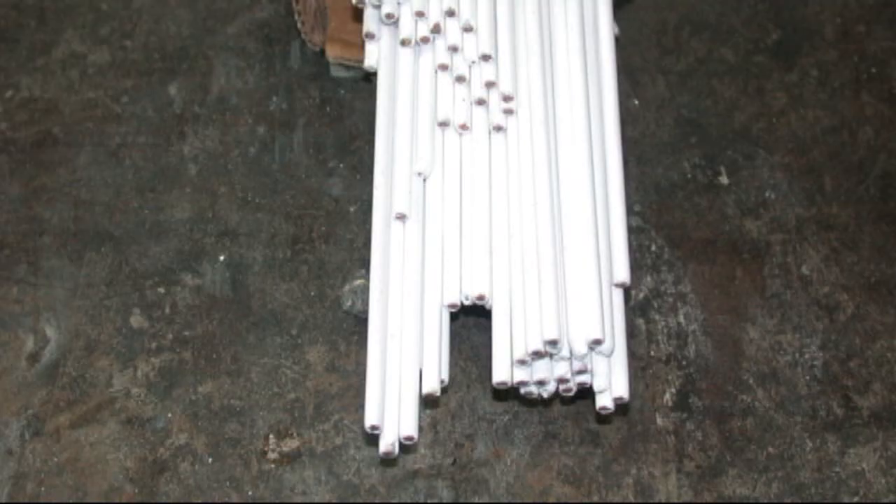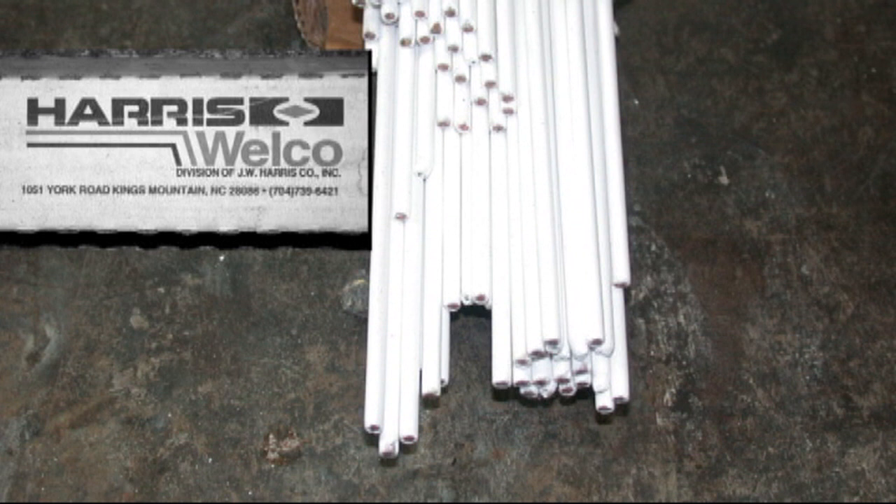This is 10 pounds of brazing rod — the most standard brazing rod I know of. You can buy this 3/32" flux-covered brazing rod at almost any welding supply. For brazing, this is the least expensive rod I'm familiar with. There are exotic brazing rods out there, but I prefer to use materials, especially for the videos, that are easy to come by. I've gone through hundreds of pounds of this standard brazing rod, and yes, once in a while I'll find a bad rod, but it doesn't happen that often.